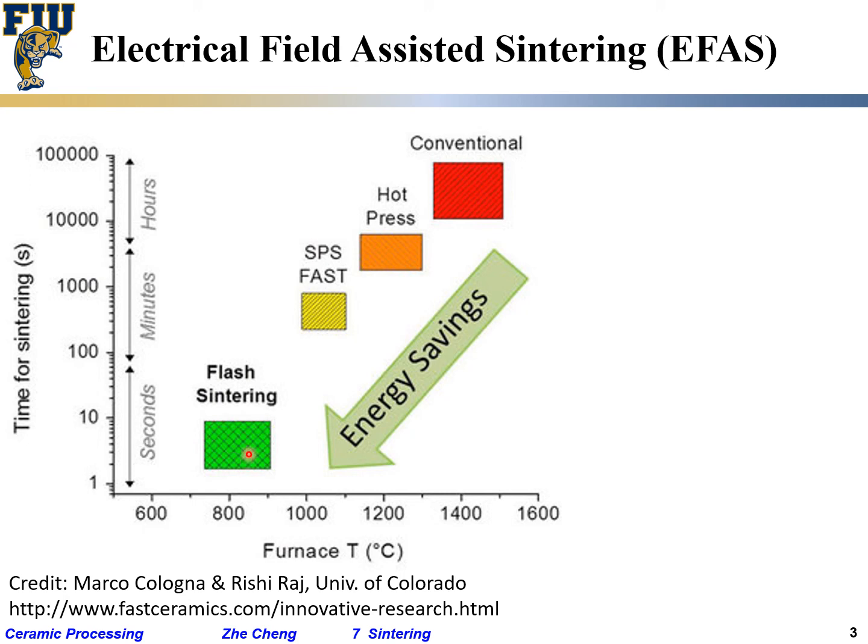But in terms of control, it's not all advantage, because if sintering happens too fast, there are also other tricky things that would happen. For example, thermal expansion. Because everything expands too quickly and shrinks too quickly, you may develop so-called microcracks within the material, which is not what you want sometimes. So it's not all advantage. But at least from an energy point of view, conceptually, when you move down this curve, we can, in principle, save energy, save time, make the productivity higher.